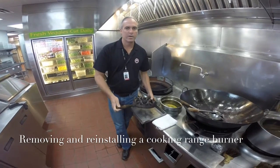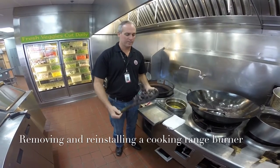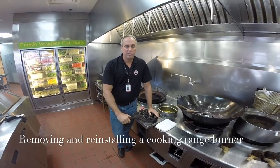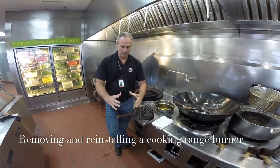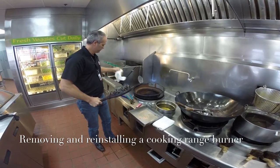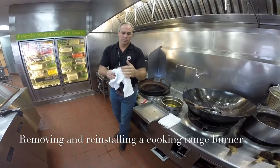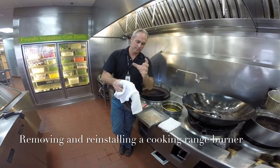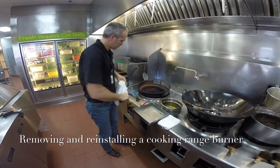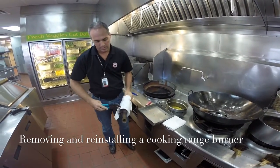You might ask: how do I hold the burner steady while I'm trying to unscrew the pipe? Many stores have a dumpster pad with a steel bollard in front of it. You can wrap the burner with a couple of towels and slide it between the dumpster pad wall and the bollard — it's held in place and can't go anywhere. Then you put your pipe wrench on, torque down, and unscrew the pipe from the cooking burner.